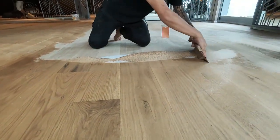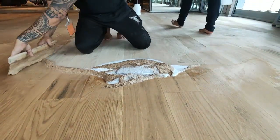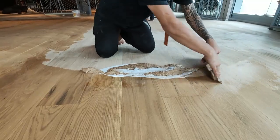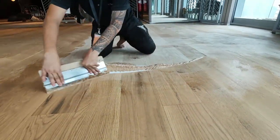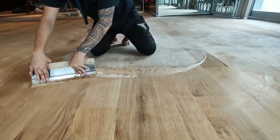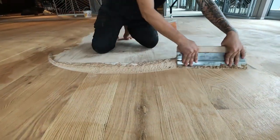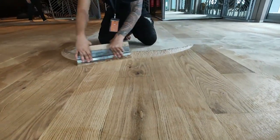For those who sand after two to three hours, especially for bigger gaps, it may take longer time to dry. During sanding, some dirt may get stuck on the filled gap, which is why the filled gap color can look slightly different. If you want a clear natural finish, it is always better to leave it overnight. But for color staining, you can sand it after two to three hours.